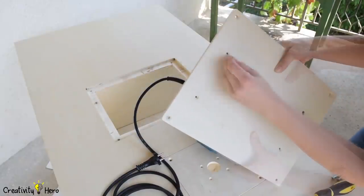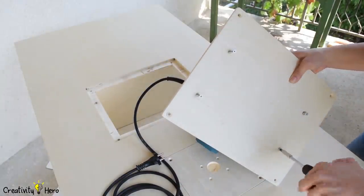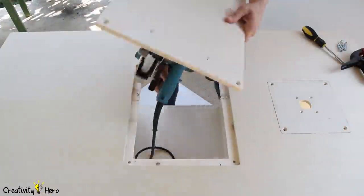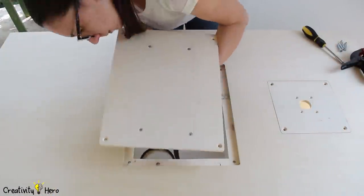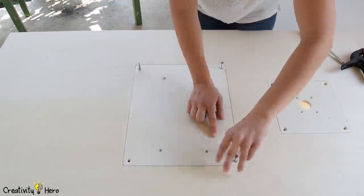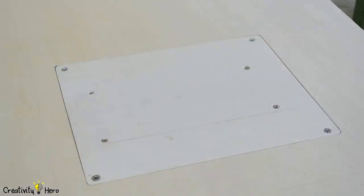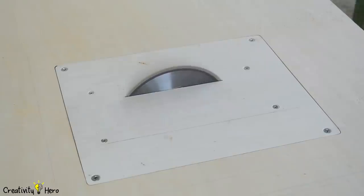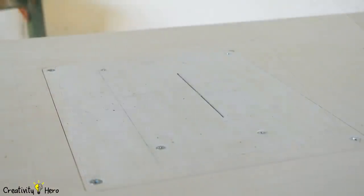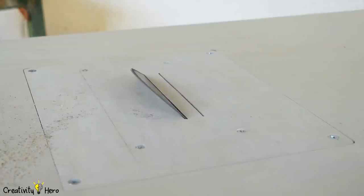You may have to drill new holes in your saw base if you can't use the existing ones. Now I'll place the circular saw below the top and make two cuts — one at a 90 degree angle and another at a 45 degree angle. I turn the circular saw on and make the two cuts through the insert. So I've turned the circular saw into a table saw — this part of the workbench is done.